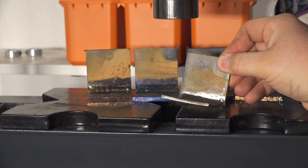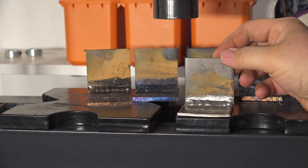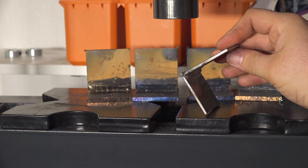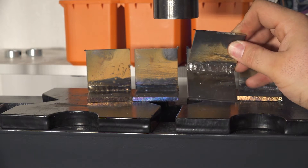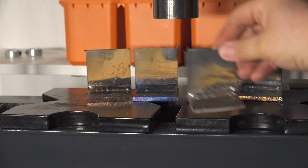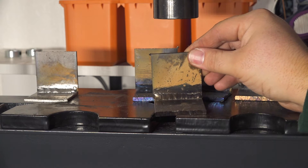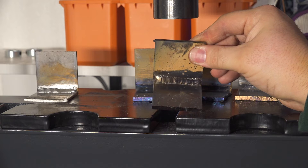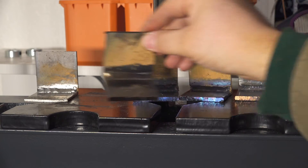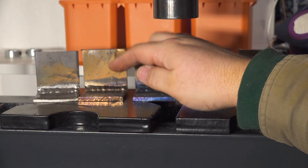You can really tell when it starts to wet out, so I just prefer the way this wire runs. As for the welds here: this first one is 1/8" material, just a straight single pass. Not the prettiest weld in the world, but other than a little cold start it went in pretty flat and smooth and seemed to be burning in well. Then I have a single pass on the 3/16" material where I went really slow — not a whole lot slower than normal, but if I went any slower it just started to build up. You can tell just how much slower it was because the metal is much more discolored.